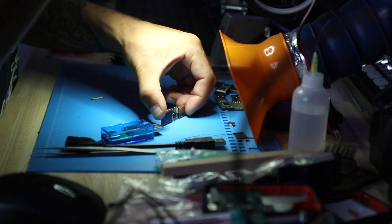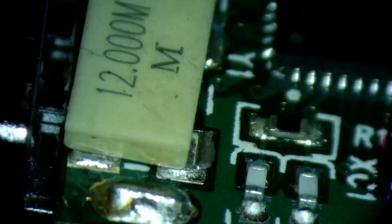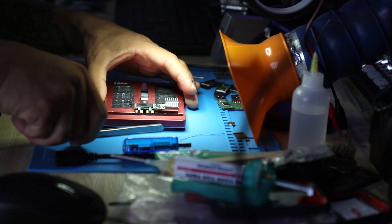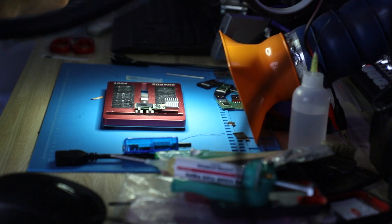Let's put it back. If I heated it up too much, it actually came off the side — see this? That's weird, I didn't think I heated it up that much, but it's not a big deal — easy fix. Let's get some flux on there, sort of a heat sink to act as a shield. Turn on the fume extraction once again. Worse comes to worst, if that component is damaged, we can always get another one.